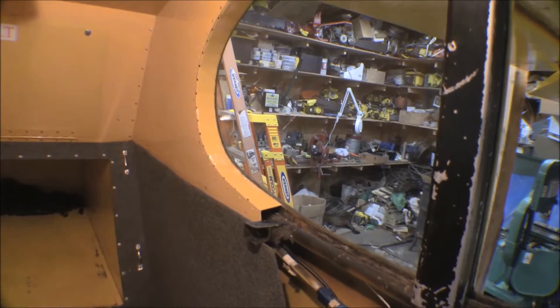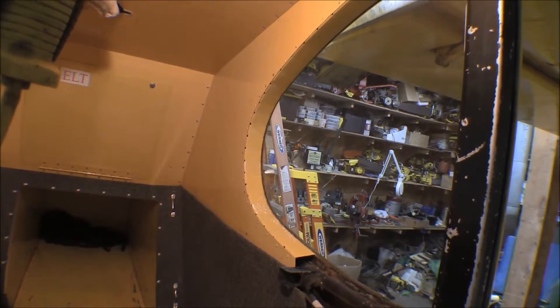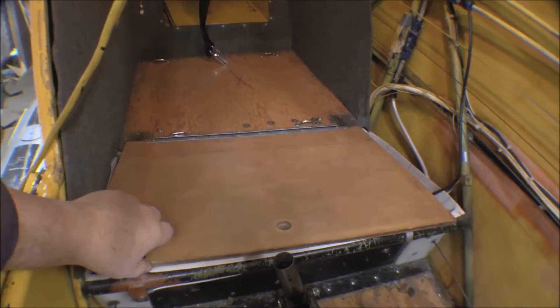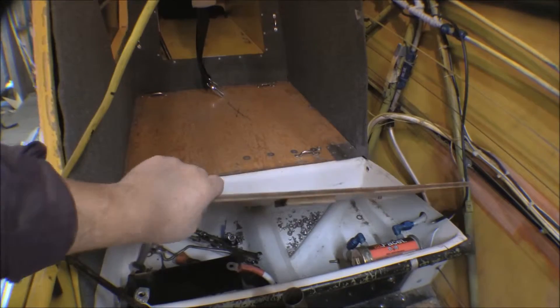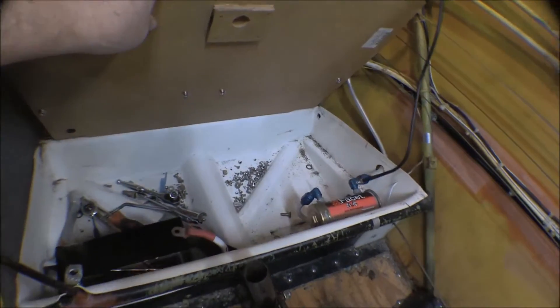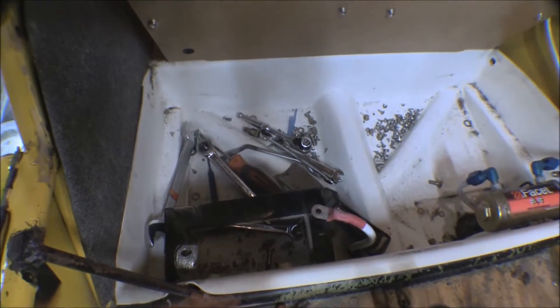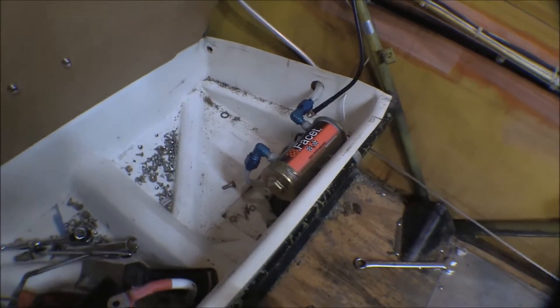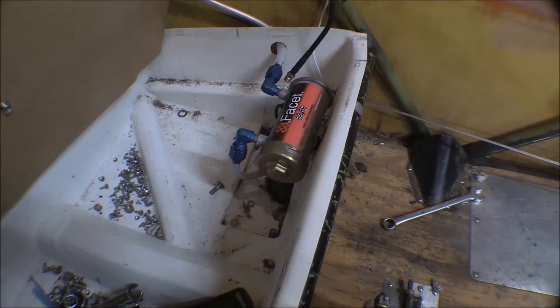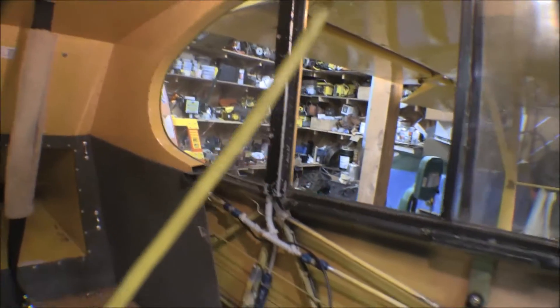You can see some pretty good rust. That's going to be hard — probably getting that D-channel for that baggage compartment out because that's pretty rusty with some corrosion in it too. This is the back seat and it hinges on that rear baggage compartment floor. You can see it's a quarter-inch piece of plywood. There's under-seat storage — a plastic tray — and here was where the battery box was. The battery's out of it though. Over there is the fuel pump. We've got a line coming up through the bottom of the baggage tray from the belly tank into the fuel pump and then out and up the sidewall, hooking into the fuel tank on the left side.